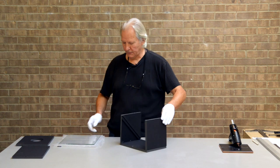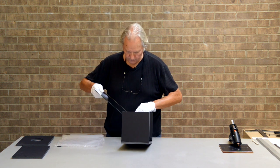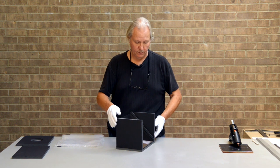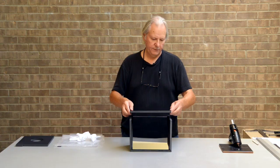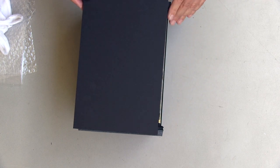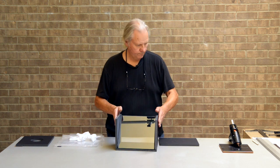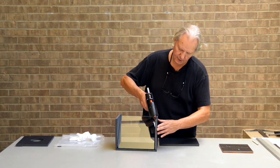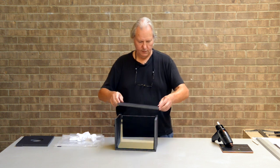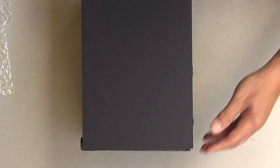The next step is to put the mirror in. The reason we're going to do that is so we can put the top on and be sure we're not pinching the box too much. Of course, we're using white gloves because we don't want to scratch the glass. We've cut this top just a little bit narrower than the width of the box to leave just a little reveal so that we can slide the mirror in and out easily. We run two beads of hot glue down the top and put our top on — just like that.